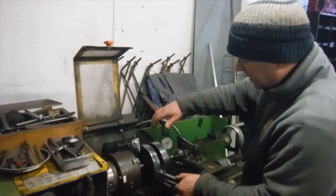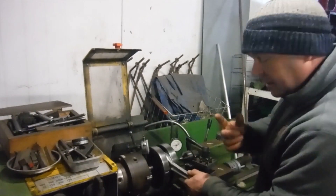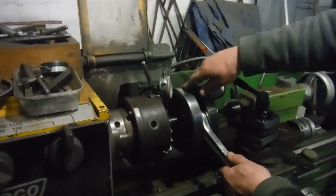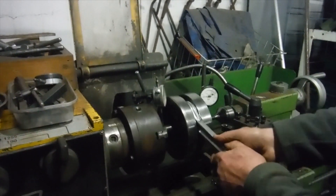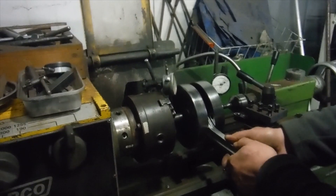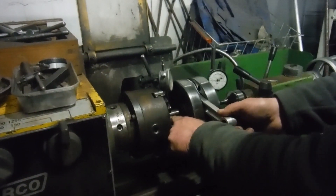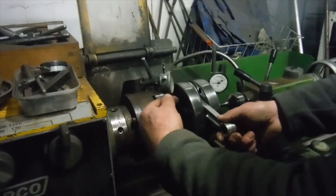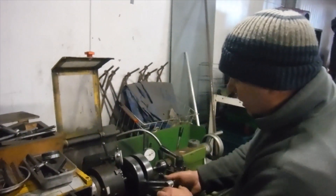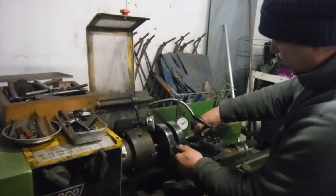We've got a crankshaft here from a 1960 Royal Enfield Bullet known as Roger, owned by a chap called Dave the Base, who's visiting today and kindly holding the camera. I've got this set up in a lathe a little differently to how I usually have them held between centers, purely because the end of the drive side main shaft — the threaded portion — is very, very slightly bent. It's not a problem mechanically or structurally. The part that runs in the main bearings and holds the engine sprocket and even the alternator rotor is fine. So I've got the drive side main shaft held in the chuck of the lathe this time, with the timing side shaft centered as normal.